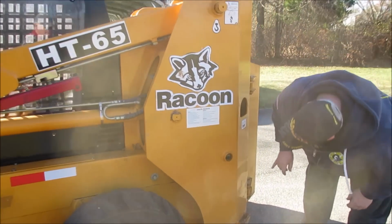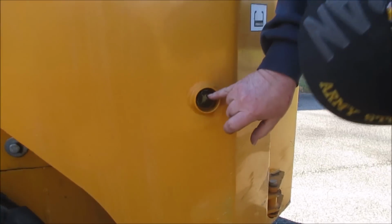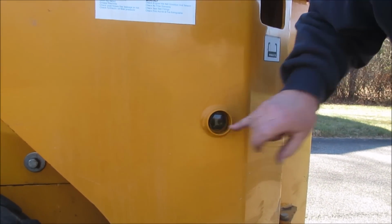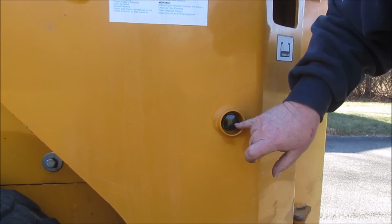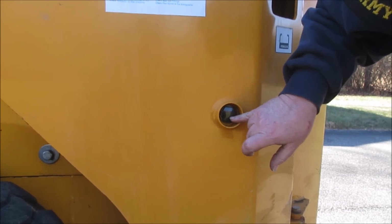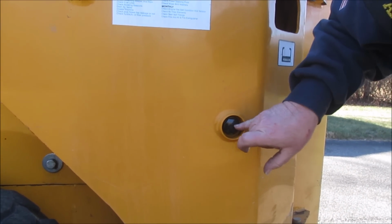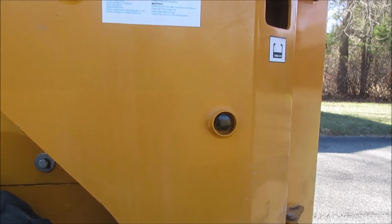Hydraulic. This was low. Right now it's right there, at the top. Okay. I thought it was like maybe 3 quarts low this morning, so I put in 2 quarts and I checked and it was a little low, and then the next quart filled it right up. But the level is right there. It should be right in the middle. So it probably got an extra quart in there. Okay.